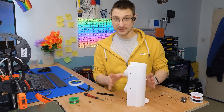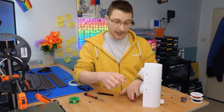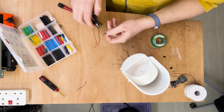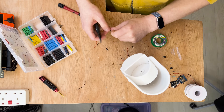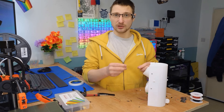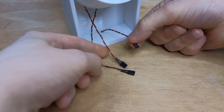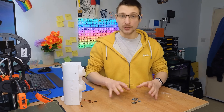With the main part assembled, we can move on to the actual electronics. I'm going to start by cleaning up the wires and adding connectors to them. I'm adding a tiny amount of heat shrink tubing to keep things neat and prevent short circuits. I'm using male and female Dupont connectors on the individual parts. To make sure I don't plug things into the wrong ports, I'm using the male connector on the piezo drop sensor and a female connector on the motors.